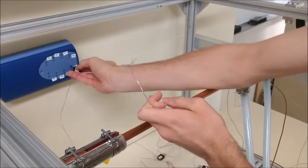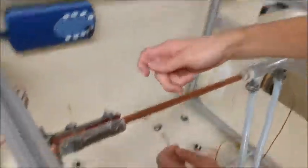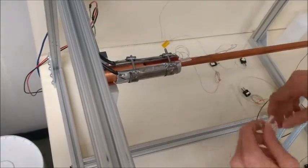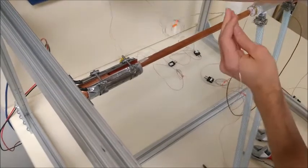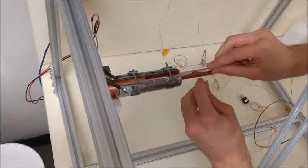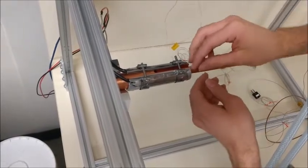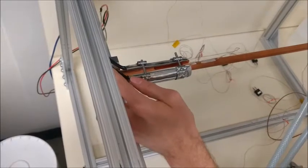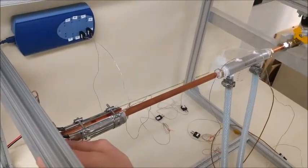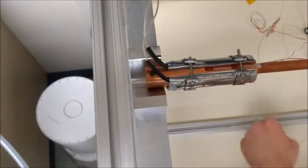The thermocouples are all labeled one through eight, and the thermocouple deck is labeled for each number. The first one, number one, is going to be at the front left, and we'll go from left to right counting up. Numbers one and two are to be in the heater section in order to capture the difference in the heating element. Then we can just slide those back in and set up the rest of the thermocouples without having to move the heat pipe.